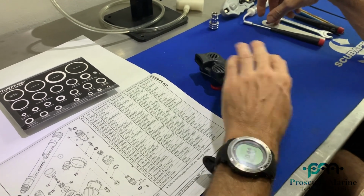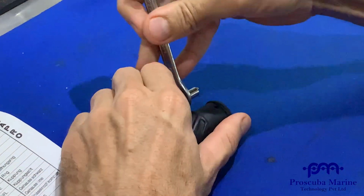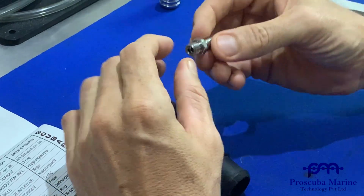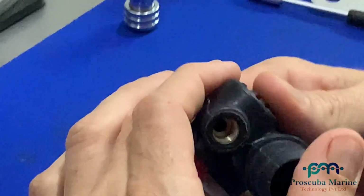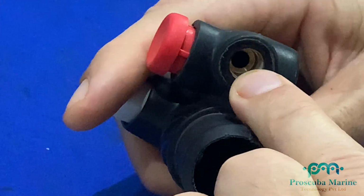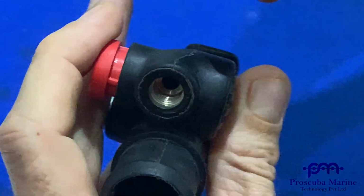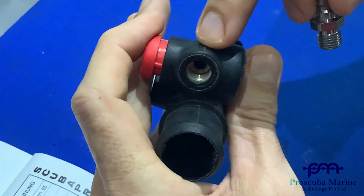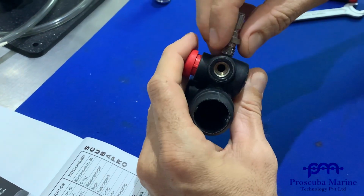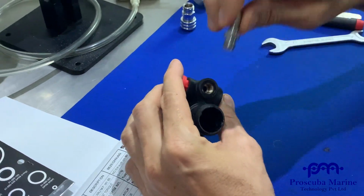Okay, so if we can start nice and easy, we can use our 12mm spanner, and we can take off our quick disconnect nipple here, and what you'll see is that there's actually a metal fitting, and it's going into a metal thread. There's actually an inserted metal thread in there that makes this connection very, very strong. It's very, very strong, guys. This is Delrin, so a form of polyurethane plastic. There's no possibility of us threading in our metal quick disconnect nipple and threading it out and then having to throw this away. This is a metal to metal, super strong connection.